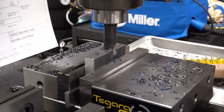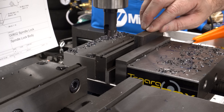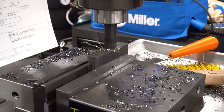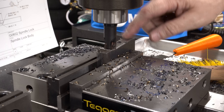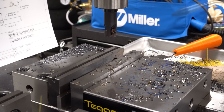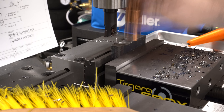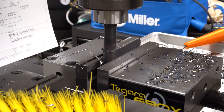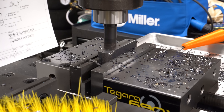With one side flat, I'll tip it up with that flat side against the fixed jaw to clean up one edge. Then I'll flip it over with the flat side against the fixed jaw and the milled side down on the parallel, hanging it out the end of the vise to measure with a micrometer. But as I milled across, it started lifting — the vise jaw was cocking at an angle and only holding on one edge, and the tool pressure from the insert end mill just pushed it up. Fortunately I hadn't gone past my final dimension, so I could put it in the center and go back and clean that up.